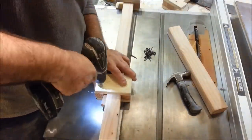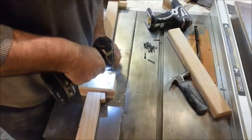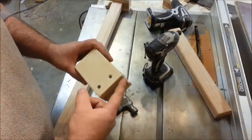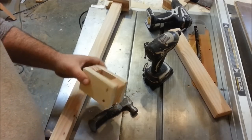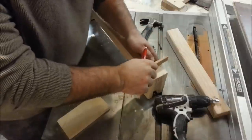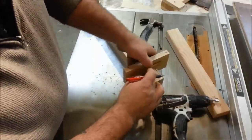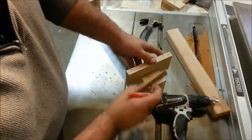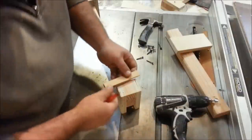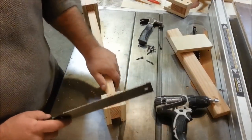After you put that piece together, you'll see the block is on a bit of an angle with a little bit sticking out on each side. You can trim that up with your bandsaw, table saw, or chop box — I trim it so it sits nice and flat along with the back piece. Next, I take my pre-cut wedge and mark that out on my headstock by placing a flat piece of plywood as a reference edge, holding the wedge in place, and bringing my tip to one side so I'm not cutting out too much material. Then I use my handsaw to cut away the waste material down to the bar.